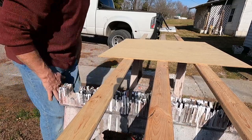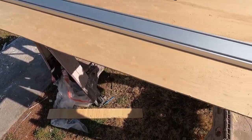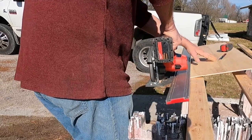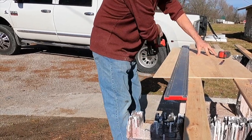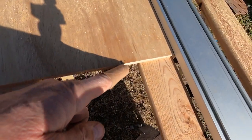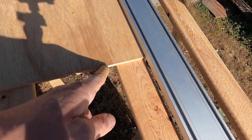It doesn't have to be a perfect cut, but pretty close. This piece of luan is not real straight, so I'd like a straighter edge. My saw width is four and a half, so I came in four and three-quarters and put this Bora track on here that locks on, just to get a straighter edge. From this edge to the cutting blade it's three and a half inches, so I measured 12 inches and then three and a half over, clamped the Bora track, and that puts me right on my mark.